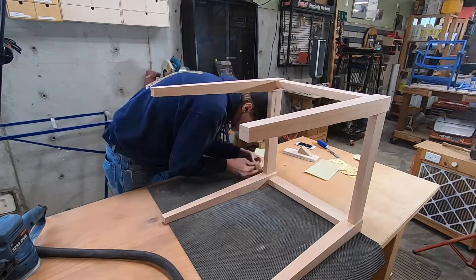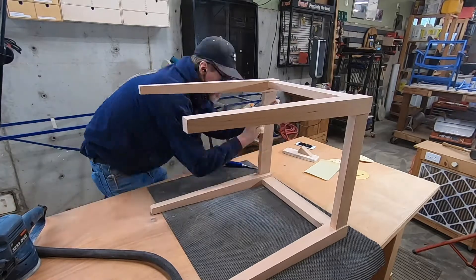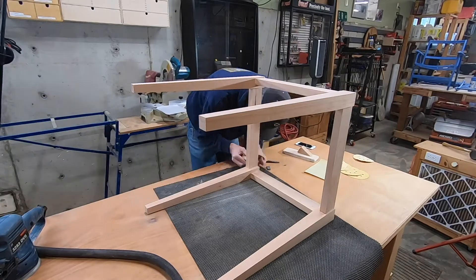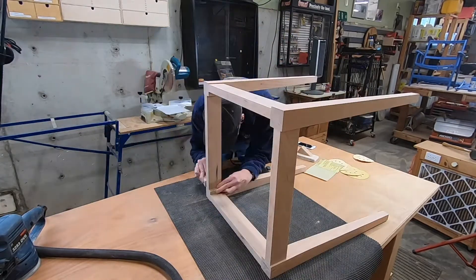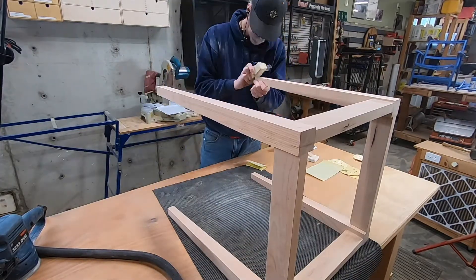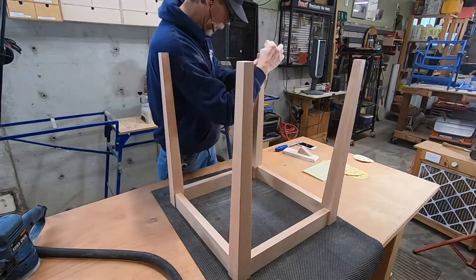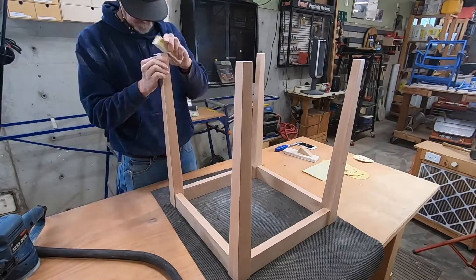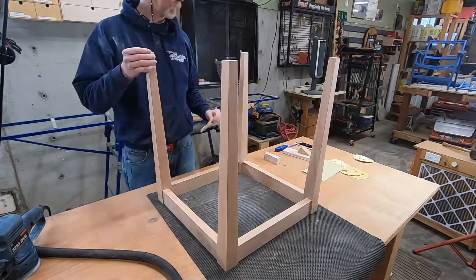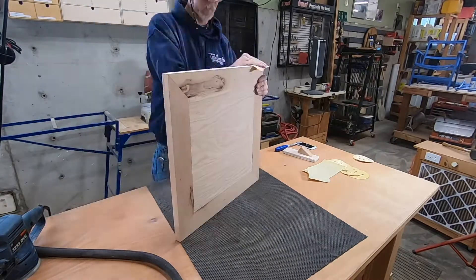This is the detail work — this is what makes furniture better. If this was a shop project, I wouldn't be doing this little tiny detail work here, making sure that all the joints are perfect. And I'm beveling the feet here, so if this table slides across the hardwood floor it's not going to splinter out. It's always a good idea — just a little bit of a bevel, that's all it takes. Hand sanding just to kind of break the edges.